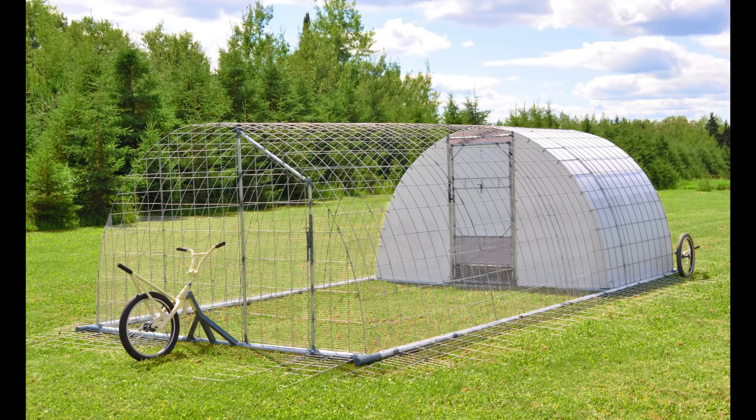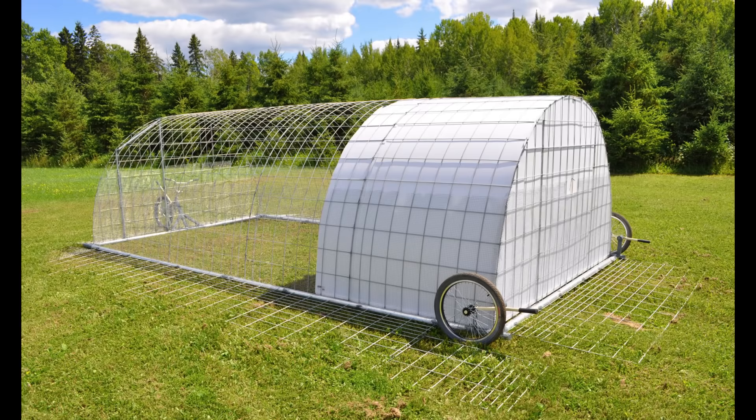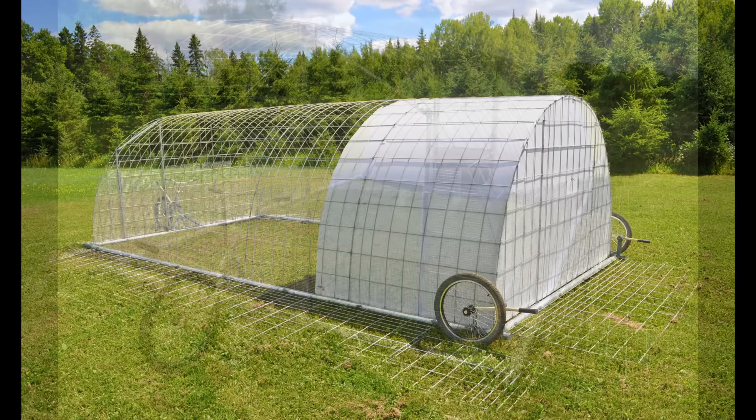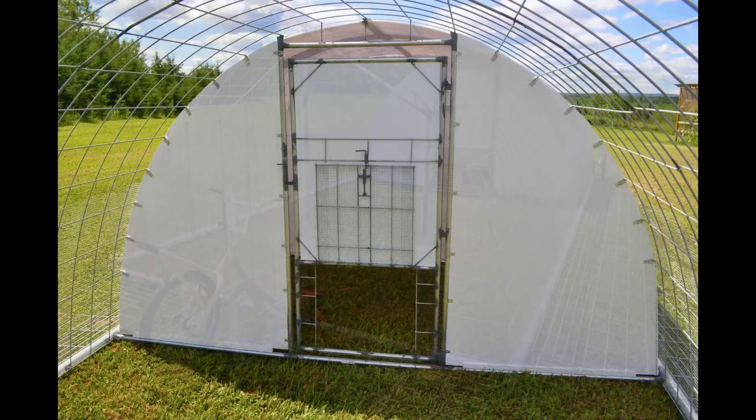Here is the completed port-a-pen poultry tractor. I painted all the joints that were welded because the galvanizing was removed by the welding process — these areas would rust, so I repaint them every year with marine-grade paint. After three years of using this, we have never lost a chicken to a predator. The total internal area is 162 square feet, so going by three square feet per chicken, you can easily have 54 birds in here. When we had large turkeys we had 20 of them in here, and the roosting area worked well — and also during the day when there was a fight and one of the birds needed a timeout.